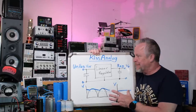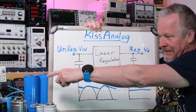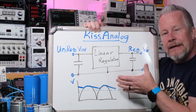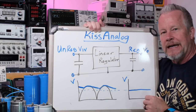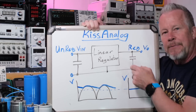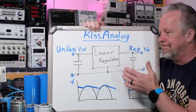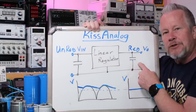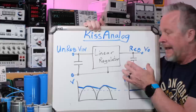So if you think that adding a breaker to your house or some solar system suddenly screwed up your sound system because of small voltage drops before you get to your receptacle — and then maybe from your receptacle to your amplifier you drop a little more voltage due to your power cable — those small minute things, if there's any chance you can hear the difference in that stuff, then a regulated power supply will make the difference. Let me talk about the linear power supply a bit more. Here's a simplified linear regulator circuit. These are the bulk capacitors coming off our bridge rectifier.